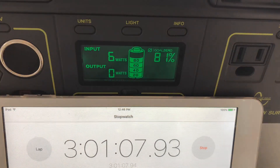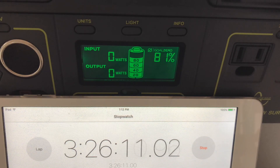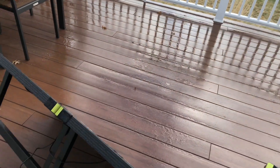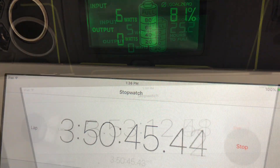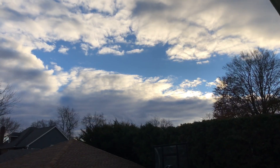We definitely had enough sunlight left in the day — I thought I was going to get to 100%. And then things went south. We started dropping and now we're at zero watts input. The reason is it got cloudy all of a sudden and then we got a surprise rainstorm. You can see the heavy clouds, the solar panels are now wet. They did okay in the rain, but that's not going to do us any favors. After quite a bit of time, we're kind of stuck at about five or six watts — the panels are putting out two or three watts each.